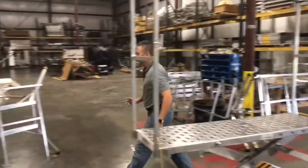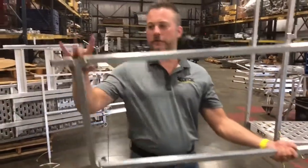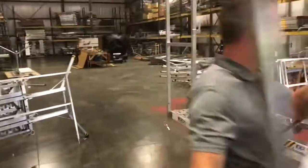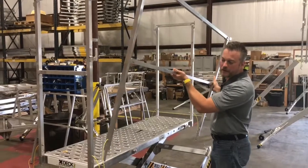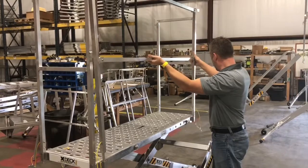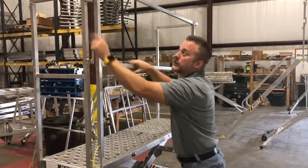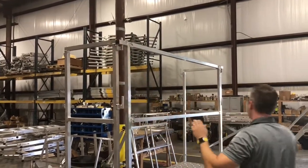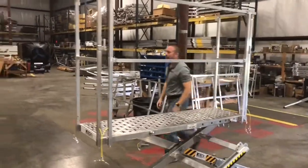The difference between the two is the front one has these hinges. These hinges allow the handrail to move. So I'm going to install this handrail. If you have handrails with kick plates already pre-installed, the kick plates are always going to be facing inward. What you do is line up the hole pocket at the bottom and then line up the hole at the top — you see these holes — drop it down in. And then you have the back handrail.